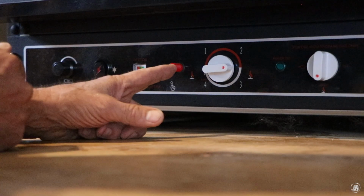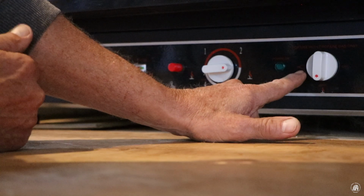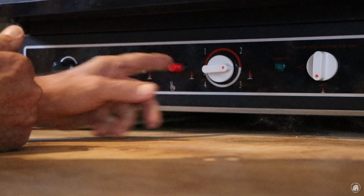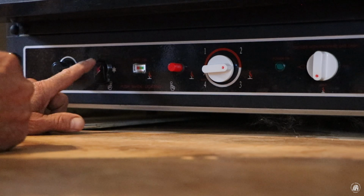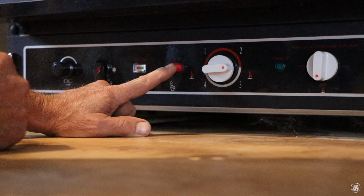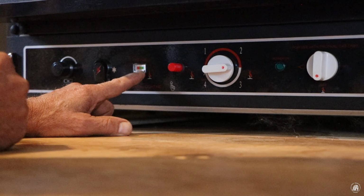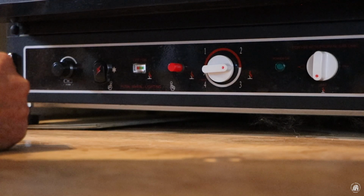Well, I've got the refrigerator started. Over here is where you turn it to propane, and it'll also run off of AC if I need it to. Here's the thermostat control. Here is, this is actually the igniter right here. And this is what you push to let the fuel go through, and you can see it's over in the green, this little needle right here. So it's working properly, and that's just where you replace the battery for the starter.